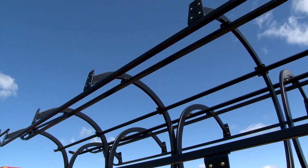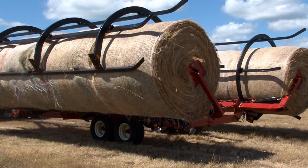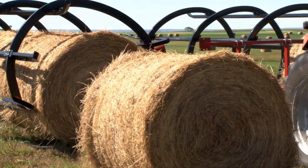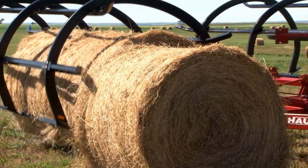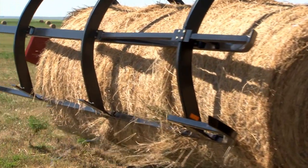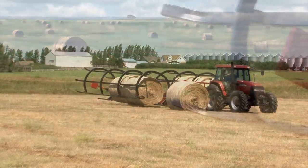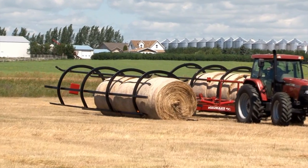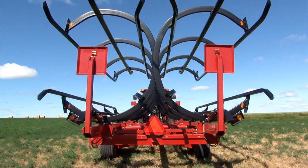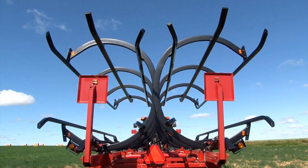The Quick Pick has two large chambers which in the field position are down on each side of the trailer. In the hauling position both chambers are hydraulically folded up on top of the trailer. The chambers are designed with an adjustable size opening at the bottom which allows the bale to enter the chamber. The adjustable opening gives the unit the capability of picking up bales from 48 inches to 72 inches in diameter. The chamber's no-snag design all but eliminates the chance of damaging strings or net wrap on the bales. Each chamber has its own rear gate which can be pinned closed or hydraulically operated to allow for drive-through unloading.